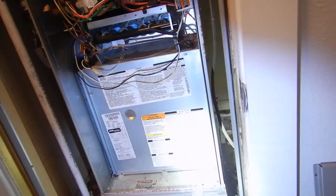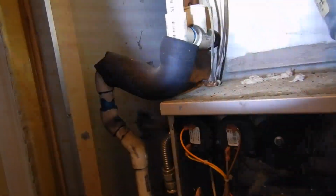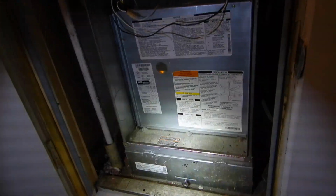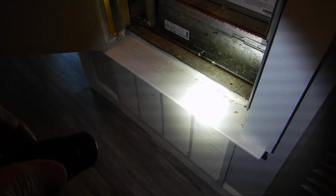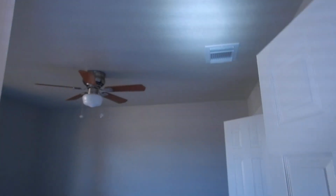Alright. Now on the ventilation side, ventilation and furnace are kind of related. Okay, so we're going to bypass the shallow P trap. Furnace and the ventilation are related in that the carbon monoxide spills out of here. It goes in here, that's your return air vent. And once it goes into your return air vent, then it shoots up through the system unencumbered, and it's distributed. Carbon monoxide is distributed out to all the vents. In fact, all throughout the house.